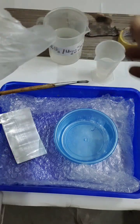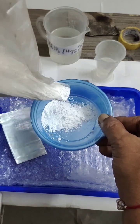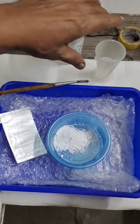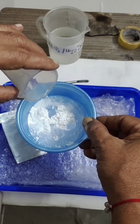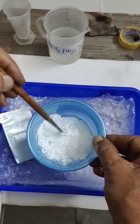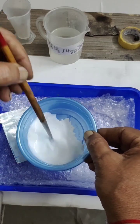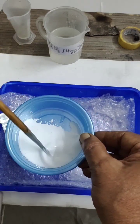I have roughly taken zinc oxide and now I am going to mix the 50% sodium hydroxide into this and make a paste. This is what we require. Once you make the final paste, see that it is free from lumps. It has now become like a thick milk — that is okay.